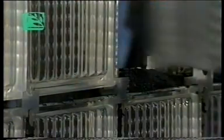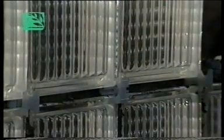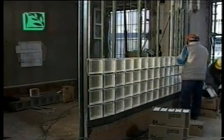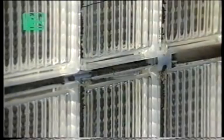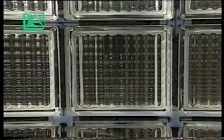The wall is then completed and the top part closed with an insulating material like that used on the inside of the uprights, again to protect the wall from possible future expansion. When the mortar has solidified, the parts of the spacers that still stick out are broken off using the handle of a hammer. The wall can now be cleaned and finished.